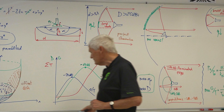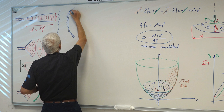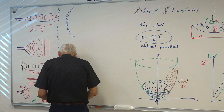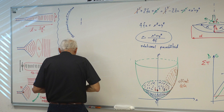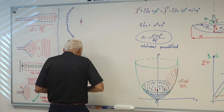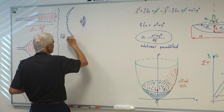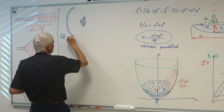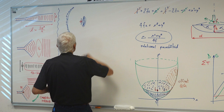What can we use as a feed for a dish? As a feed for a dish, we can simply put — this is our dish — a dipole in front of a metal plate. This is maybe the simplest feed we can think of: a half-wave dipole generating a field here, and some kind of small circular reflector behind this dipole. This feed is okay to illuminate a deep dish with F/D in the range between 0.3 and 0.4, with an illumination efficiency of perhaps 50%. This is not very good.